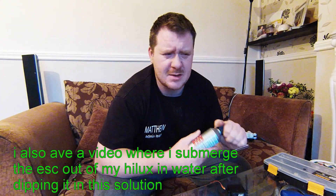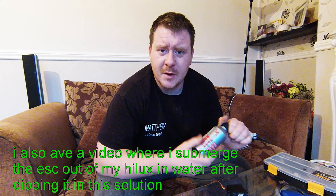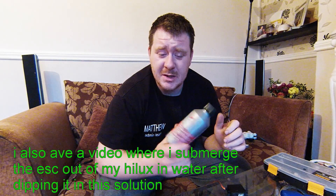Have a look at Squiddle OD's YouTube videos — he shows an AX10 fully submerged underwater using just that. It will work with a servo too, but the last thing you want is water getting into a servo because it corrodes the bearings in the top and all the gears. If you're going to make it waterproof, you may as well make it properly waterproof.